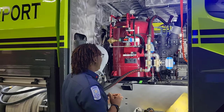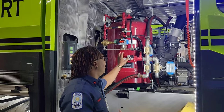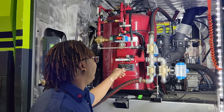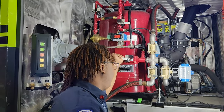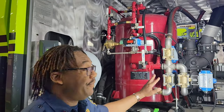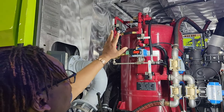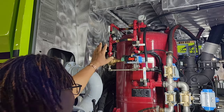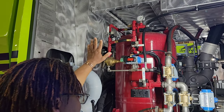When you come on this side, the first thing you need to do is come to your dry chemical valve. I'm gonna pull the pin — it's normally open — and you're gonna close it. So now I've closed the dry chemical from going anywhere. My purge valve and my charge valve, I'm gonna leave them exactly where they are. The charge valve is normally open, which it is right now.